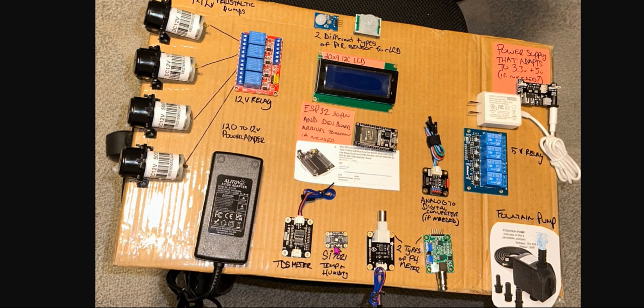I think you are using this sensor too. So SIO7, GND of this. We are not using this one. The pH meter we are using should be the one with analog out, right? So you see the one with analog out. So the pH and the TDS. So you can use the one with analog. Both of them have the same pin. So you have this one also has GND. The pH sensor has GND. The relay has GND. So you are not using this analog to digital converter. It's not needed. So you can remove it.